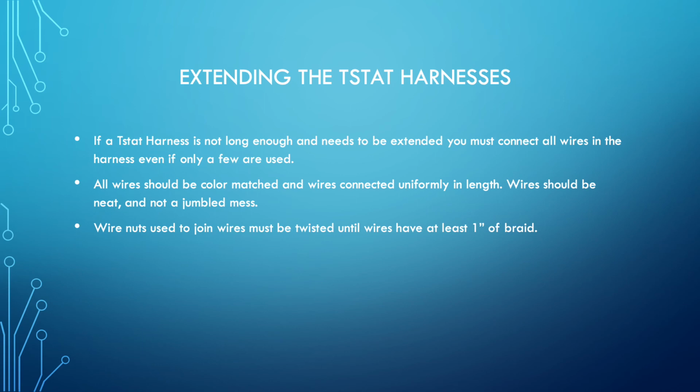The picture that I showed where the wiring was cracked on a lot of the insulation is an example of where we did that. You snip the entire harness back and de-sheath it going back, without doing a circular cut on the harness insulation sheath, but you do a lengthwise cut.